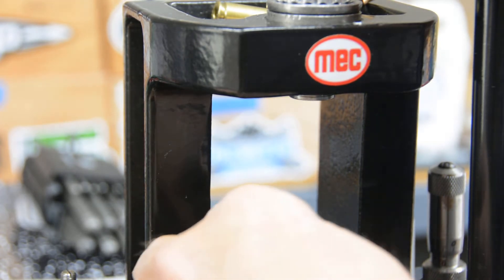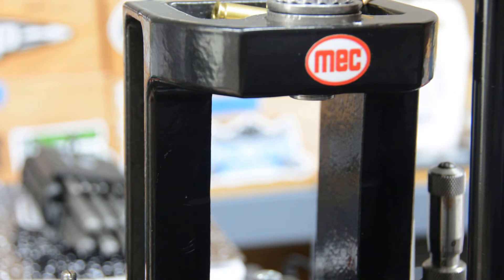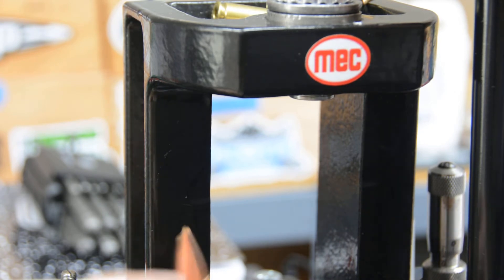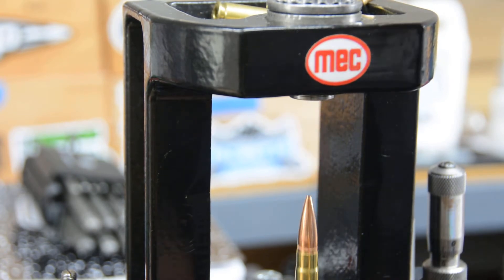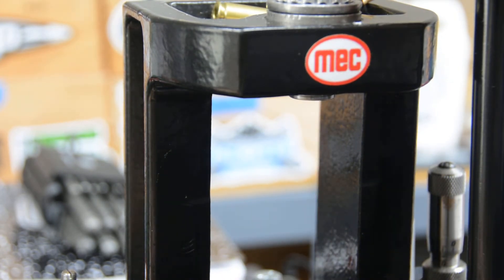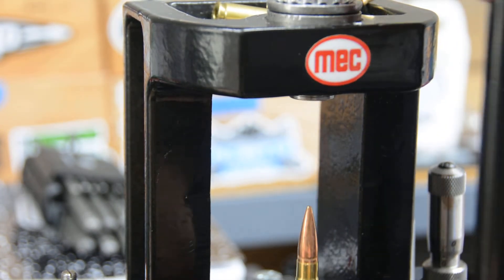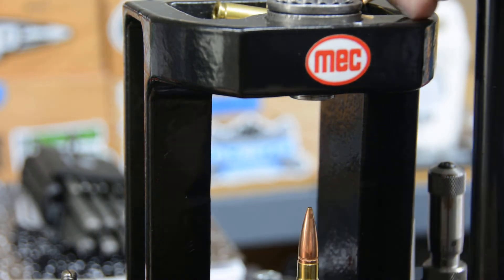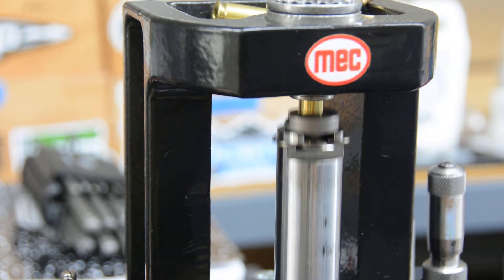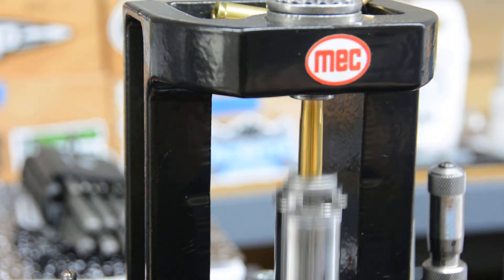One, I made my own — I converted my own .223. That's nothing new or revolutionary, but there are some lessons learned along the way that a lot of other people have paved. I found a head stamp that works well according to a good list out on the net that tells you which cases work better than others and some that absolutely don't work. I have a lot of .223 brass, so I sorted those out and converted the brass.